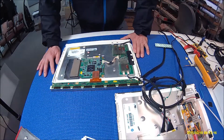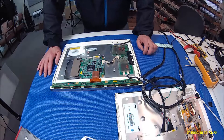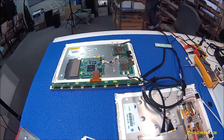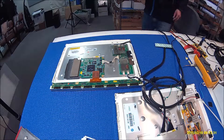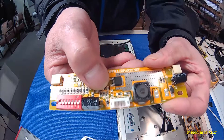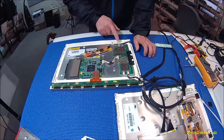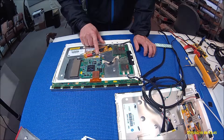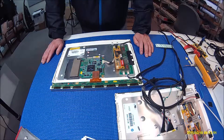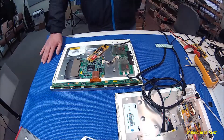Because this inverter is using a little bit of a tricky enable — you know, the enable is only 0.6 volts, so it's not going to trigger that MS456 on. So the only way to get around this — the MS456 — is to short out JP2, right here. After JP2 is shorted out, you just connect to the driver first, and then the LED turns on. But again, as soon as you plug in the power, the LED comes on for this particular inverter. Thank you for watching.